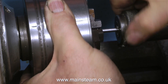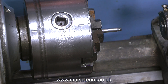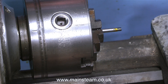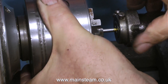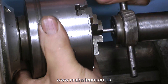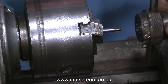There are two things causing this problem. The first is we're working with stainless steel, which is a very strange kind of metal — it work hardens very quickly. If you drill stainless steel and don't keep the drill moving by applying constant positive pressure, the stainless steel will work harden, and the incredible amount of friction will cause the metal to glow red, the drill bit will also glow red and immediately stop cutting — that's a drill bit ruined. The same thing happens with the die: it fills up very quickly with work-hardened stainless steel, which then tries to cut as well but instead destroys any thread you've already cut.